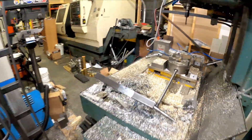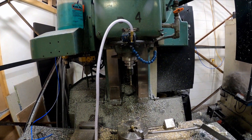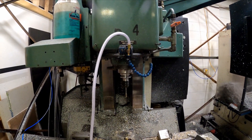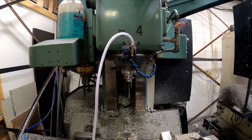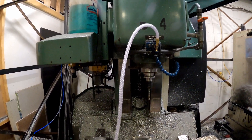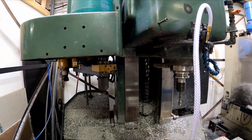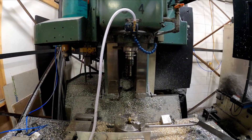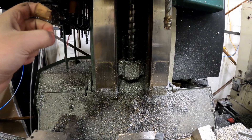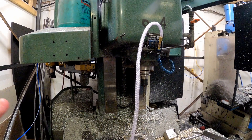One thing I don't run is coolant. The guy before me had the spindle reground and new bearings put in, but he assembled it — and there were a few other bits he messed up on. The oil lines were all disconnected, and the gib strip for this side of the casting — the screws must have been loose and they've chewed into the casting and made quite a mess of it. So sometimes when it gets quite low down the head, you can hear a bit of a scrape, and it's also worn the Z-axis ball screw out by about two and a half thou.